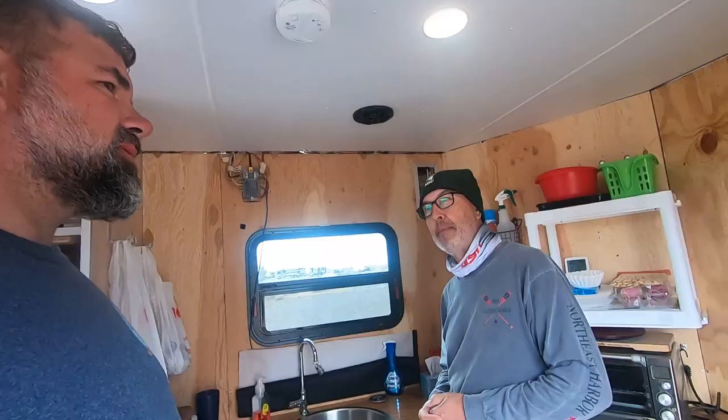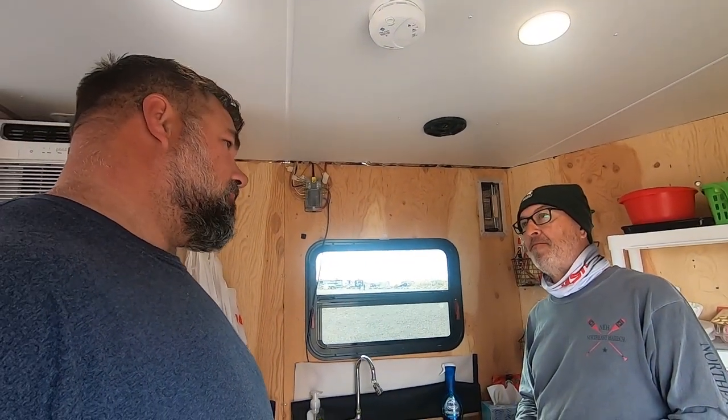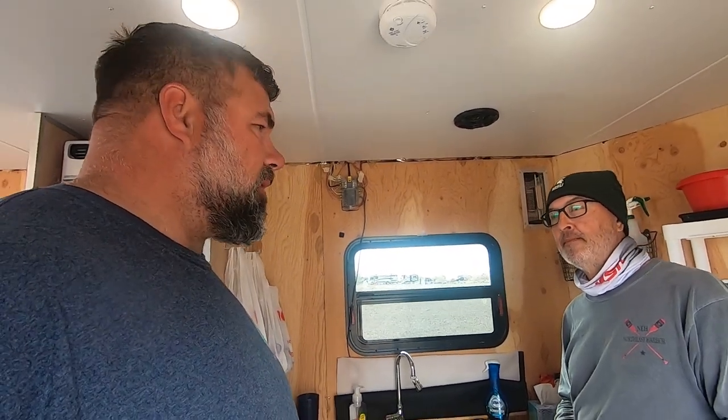Eventually, although I really like my Whale pump. Eventually when I go away from this water system, then I've got the 12 volt already plumbed in down there to go with the water pump and things like that. So you may never want to do that though. That thing works good. I might not. I'm really liking it. I use so little water. I could see, like, if you wanted to do an on-demand hot water heater, you might want to pump, because you got to have a certain flow to get it. But I don't know if you plan on going that big even.